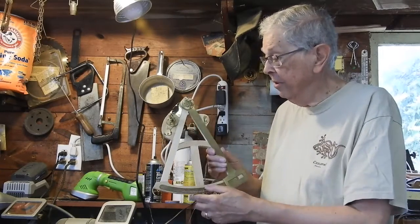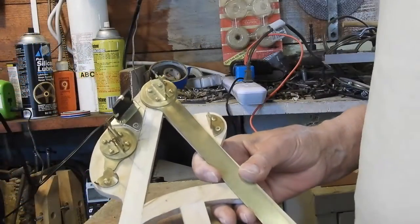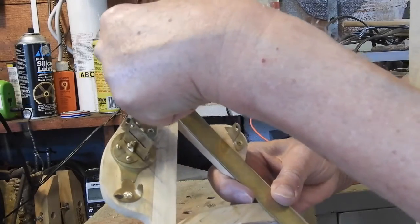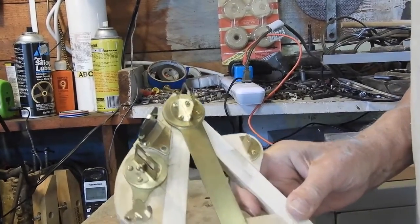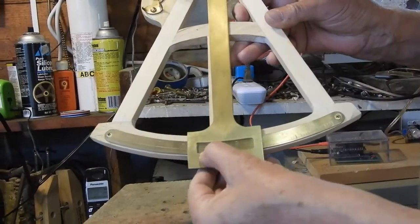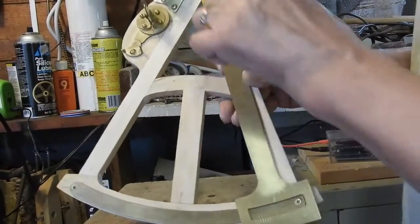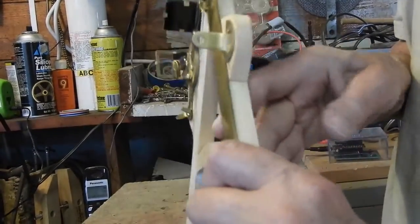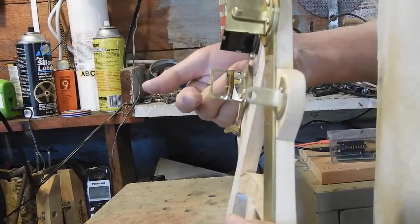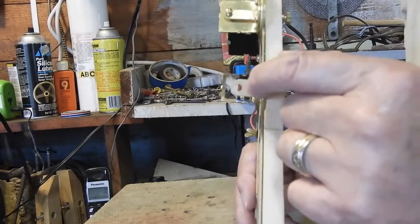There's the back, there's the front, there's the view. In the up-close version, the light comes down to the index mirror here, and then it reflects depending upon the angle of the index arm. At the bottom of the index arm there's a protractor arm and a scale on a vernier. The light then gets reflected down to this half-mirror here — clear above and mirrored below — and then reflects the light through the sight.